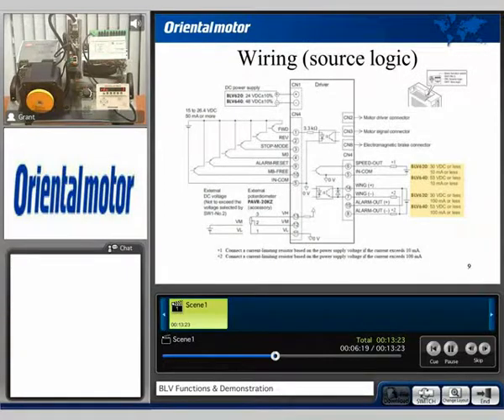This shows the PNP type or source logic, which we will actually be demonstrating via this unit here. This is a PNP type PLC which we'll show for demonstration purposes. We will actually be supplying each input with voltage. Internally there's a 3.3 kilo ohm resistor which would limit any current going to these inputs.